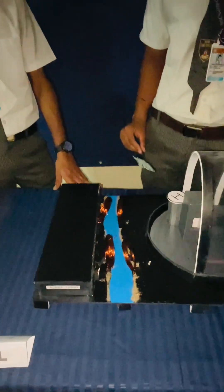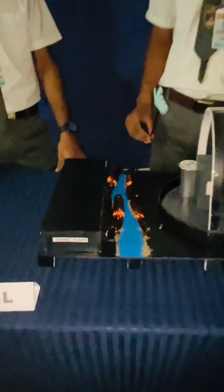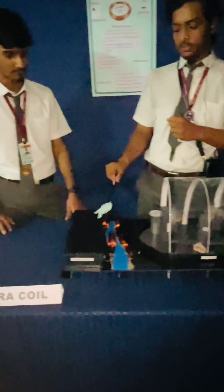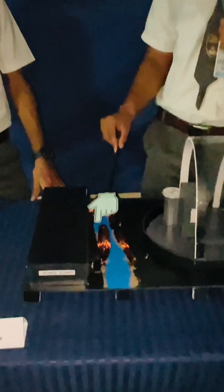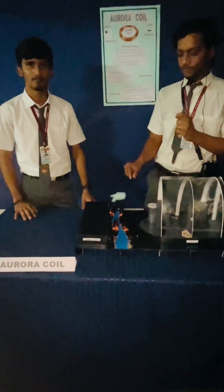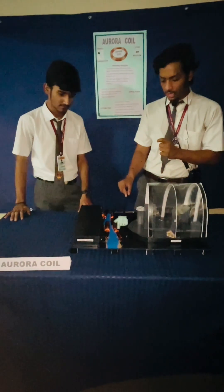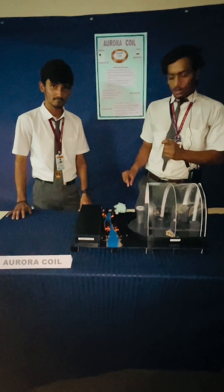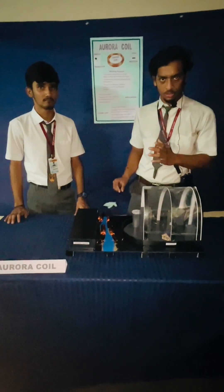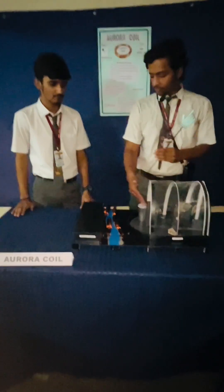The main component is the copper coil which is of 27 gauge and 40 turns, which is the main component for the induction of electricity. Because of the AC current, there is a change in the magnetic flux produced in these two coils. The flux from these two coils links with another two coils, and due to the change in flux, electricity is induced, from which current flow is possible.